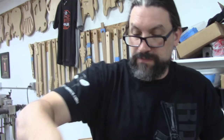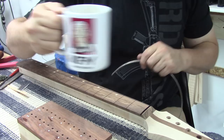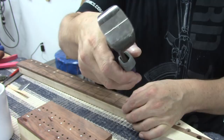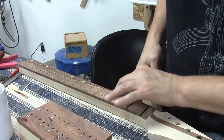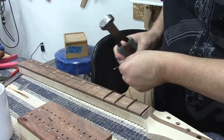I got my neck, my block, my wire, and some coffee. I like to cut the fret wire pretty close. To do that I have these tang nippers that I've ground down so they cut nice and square. I want to overhang just enough to make sure I have enough fret wire. We are going to eventually undercut these frets and glue them in.